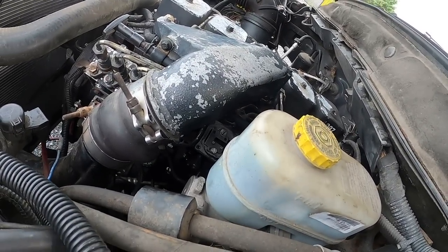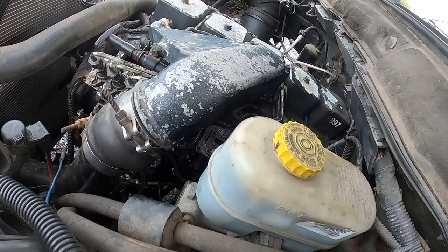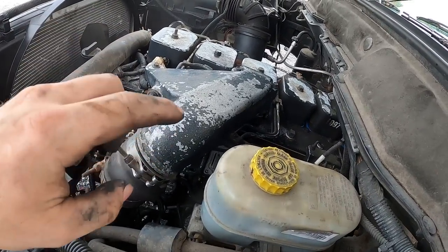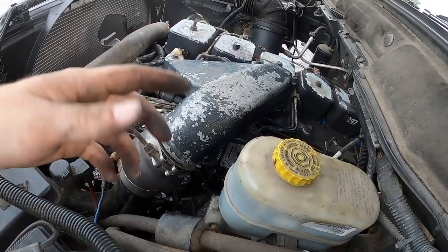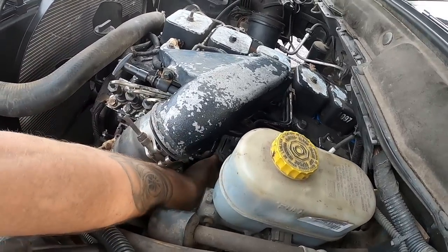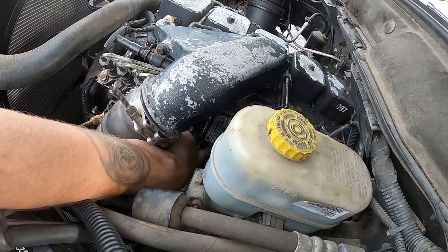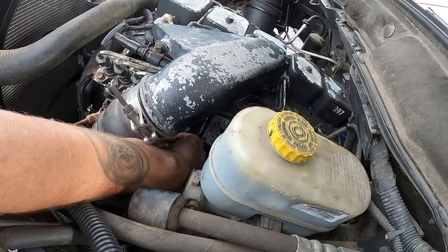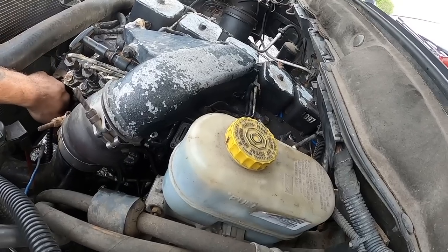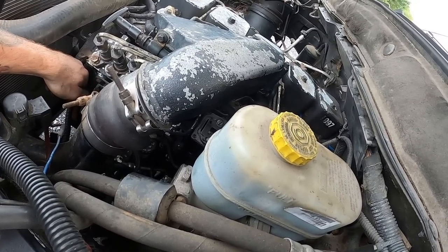You can see down there — the fuel plate is all right there. I don't know if the fuel plate was ever moved, but it's all the way forward, so somebody did mess with it. I'm gonna get in there and grab it. It looks like a factory plate, but who knows, maybe somebody modified it. My thing is I want to see if the fuel shutoff is working correctly because it feels pretty loose. I'm not sure how these should feel, but I'm hoping something's just stuck, and when you give it throttle it doesn't exactly move all that far.